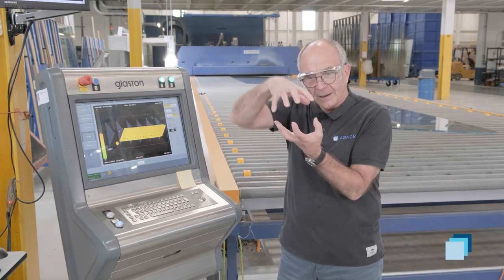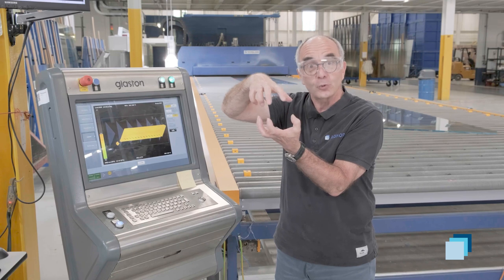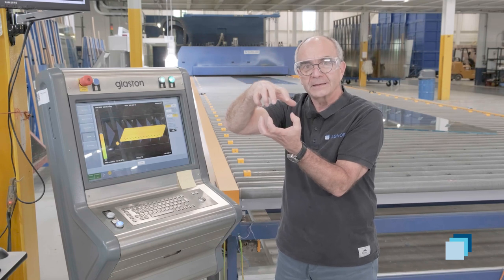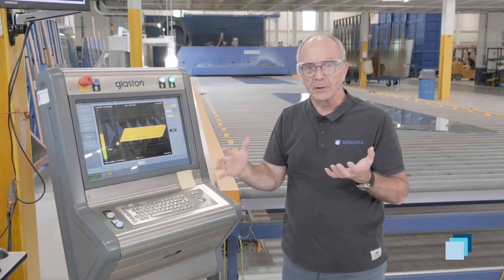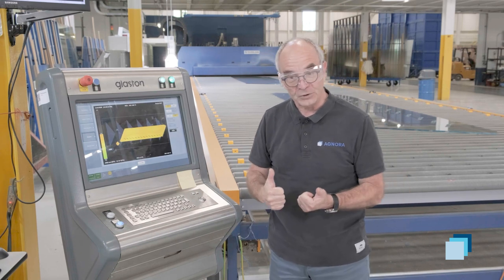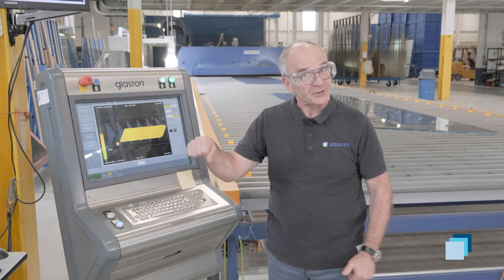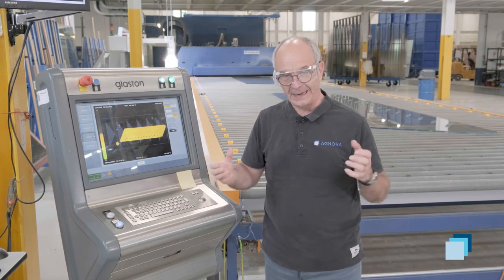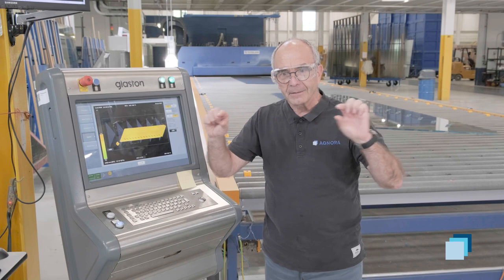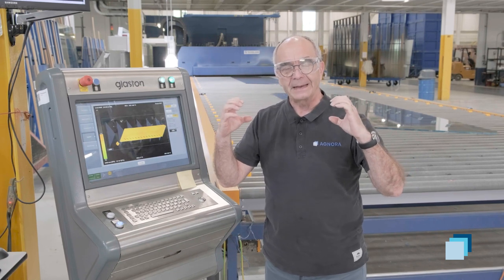That creates the two surfaces of the glass to mechanically shrink — they are shorter — and that creates more strength for the overall piece. Tempered glass is stronger, but it flexes the same way and it's scratched the same way. It's just that inner skin we create that forms a block which increases strength.